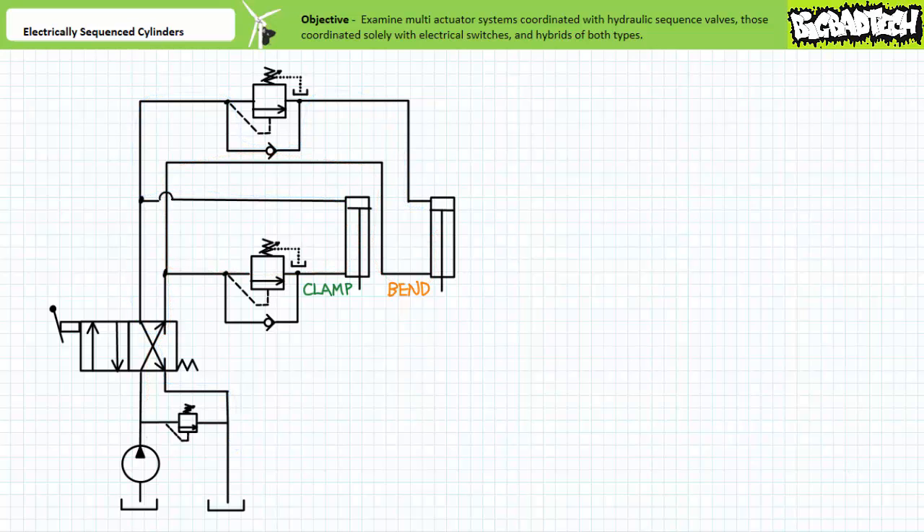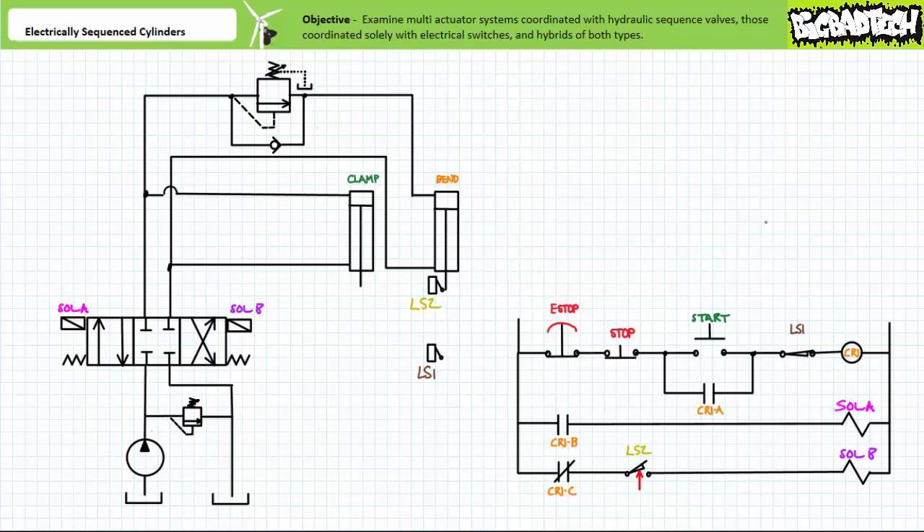Note that as currently implemented, these systems making use of hydraulic sequence valves only make an actuation decision based on pressure only. The system never actually checks if the clamp or bend cylinder have fully extended or retracted. This could be problematic if the clamp or bend cylinder ever reached the limits of travel early due to an obstruction, or had a blocked port — pressure would still rise to the sequence valve set value and the bend or clamp cylinder might actuate prematurely. For this reason, consider this slightly more robust electrically controlled clamp and bend circuit making use of not only a sequence valve but also limit switches that confirm the physical travel of the bend cylinder. Not only does this system offer similar functionality, but the sequence can be initiated at the touch of a button, freeing an operator from the necessity of having to manually shift and hold a valve in position.